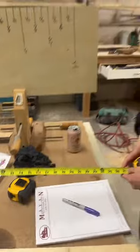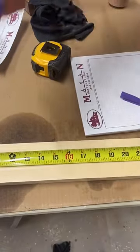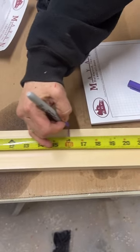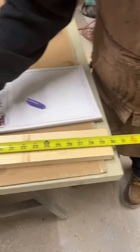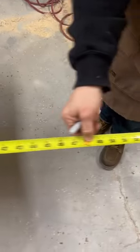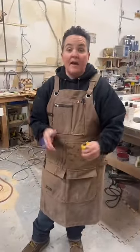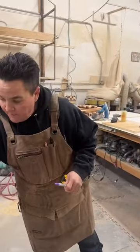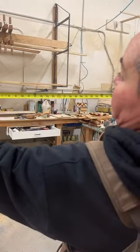That is because this is for laying out studs in a house, because you want them at 16 inches on center. So the middle of one stud would be there, and the middle of another stud would be here if I had long enough. So these red squares around the 16, the 32, 48, 64, those are what we call on layout. If you are framing a house or a wall, those points should be right where your studs are: at the 0 point, at the 16, at the 32.